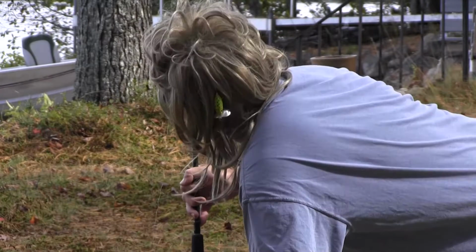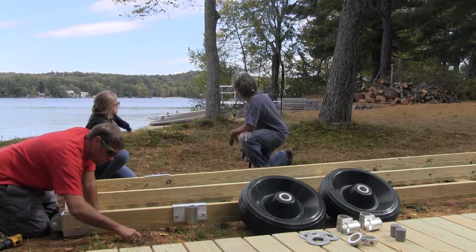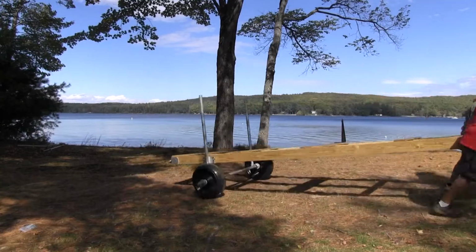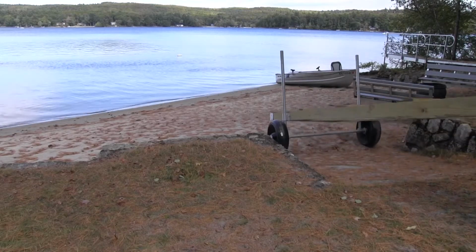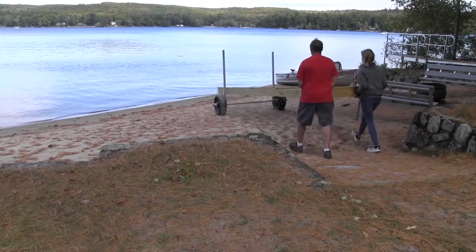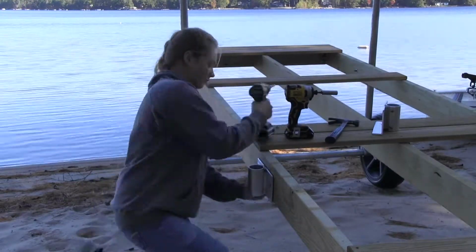In the long run, the dock wheel kits will save you time when installing larger dock systems, allowing you time for other things. Mounting your wheel kits towards the middle of your dock allows it to make much sharper turns than if it were on the end of the section. It also takes the weight off each end.